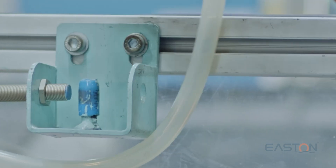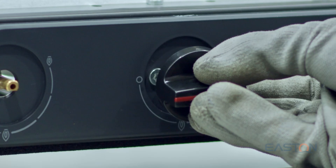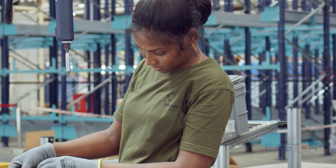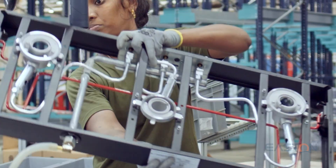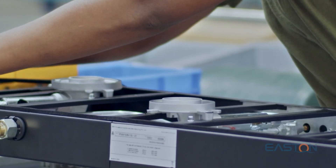E02 bubble leak indicator 2. The same process as the previous bubble leak test is repeated, and with this, the leakage test as per BIS regulation is completed. D01 tempered glass assembly 1: structural parts like the tilt-and-stay leg and the gasket are assembled here in preparation for the final assembly.